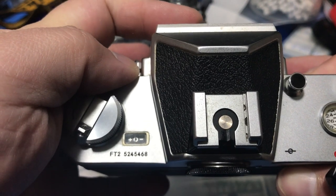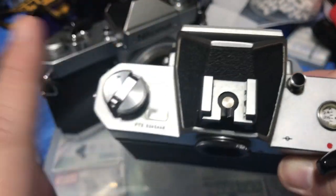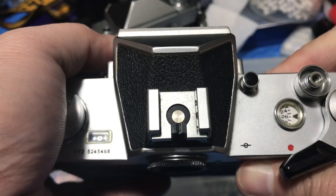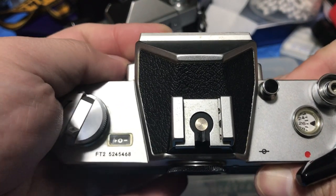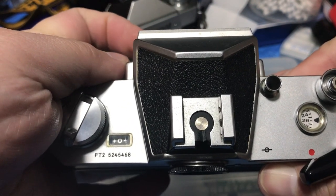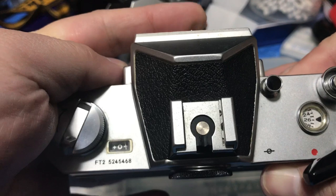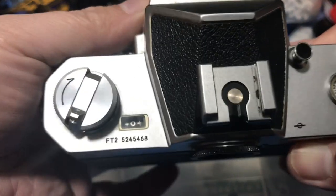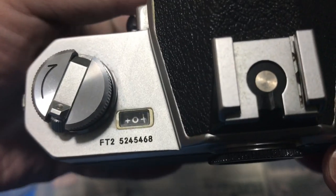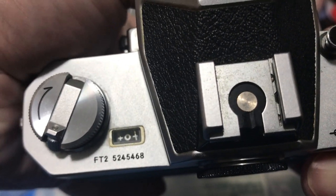You want to see the galvanometer move smoothly and not jumping erratically. If it did that, then the CdS cell is probably dirty or maybe near dead. Sometimes you'll see it do something like going back and forth — observe the needle, the galvanometer.